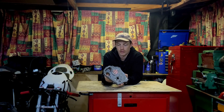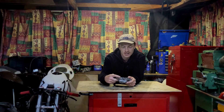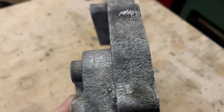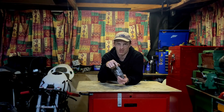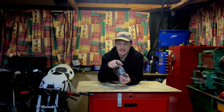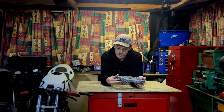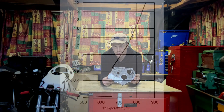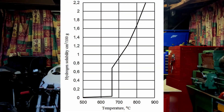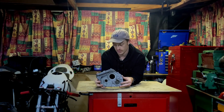This is the third time I've lost foam cast anything, and it came out perfect. There are a few leakers — a leaker is where the aluminium breaches the plaster, mixes with the sand, and you get these little defects. They'll just come off with a grinder and a paddle wheel. Other than that it came out perfect — I can't see any porosity. One point I took on board after talking to the foundry was keeping the temperature under 720°C, because above that the aluminium readily starts absorbing hydrogen gas, which means more gas dissolved in the melt and a more porous casting.